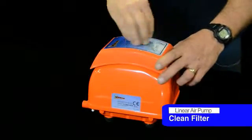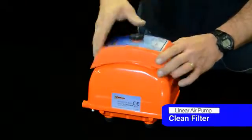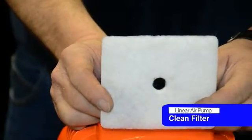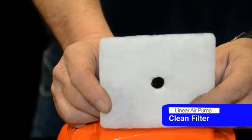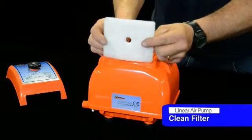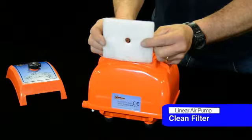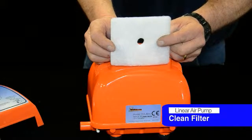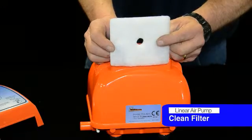So initially what we're going to do as part of our maintenance, we're going to clean the filter. Pretty easy, just take the top off. There's a filter in here. You'll want to be sure it's clean. Obviously this is a new one so the filter's clean. An existing one gets dirty every 500 hours or so and you want to clean it — sometimes more frequently depending on where you're at and what you're doing. Soap and water, get it good and dry when you're done. You can reinstall it or just replace it.